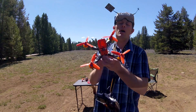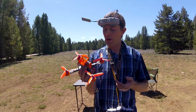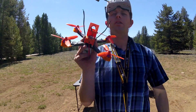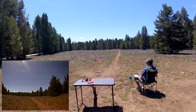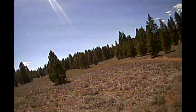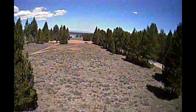I'm going to try this mini Turbo Wing VTX. It just has a simple dipole. Obviously this thing's meant for a two-inch quad or something else, but it had the same plug and I'm running Turbo Wings on my quads, so I just plugged it in — simple, some double stick tape. Let's see how good this dipole antenna works. On 25 milliwatts with the dipole antenna, I easily get to about 400 feet away — that's when I start losing signal.